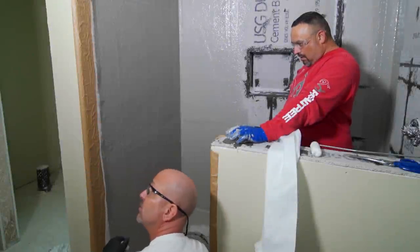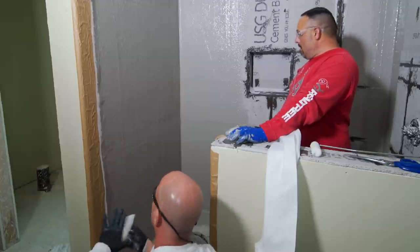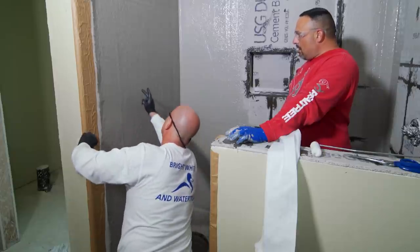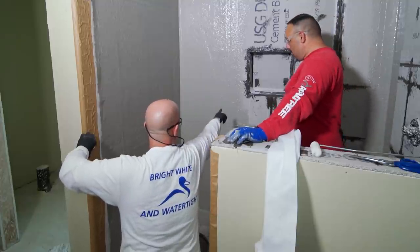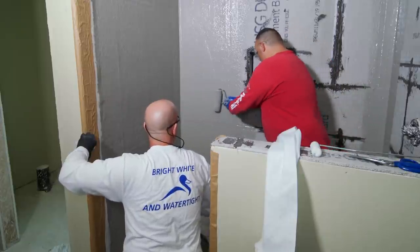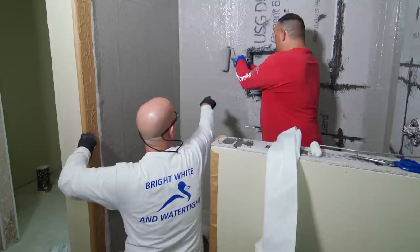Take the scissors and try to get a clean straight cut — try to get it straight. Make sure that's fully saturated. Do you see any areas that look like they could have a little bit more of a shine to it? Move your head a couple of angles. See that little wrinkle right there at the edge? Run your roller that way and flatten it right out. Don't push real hard until it pulls away from your corner.